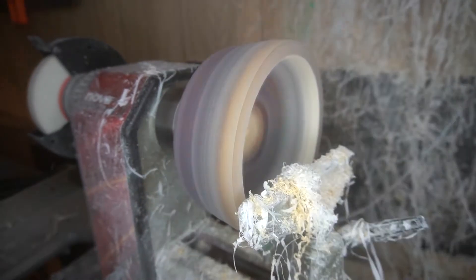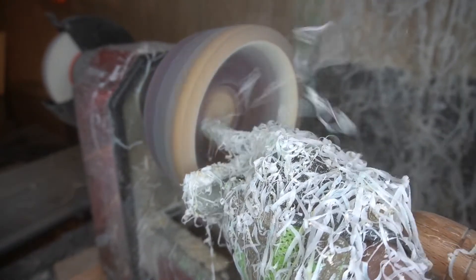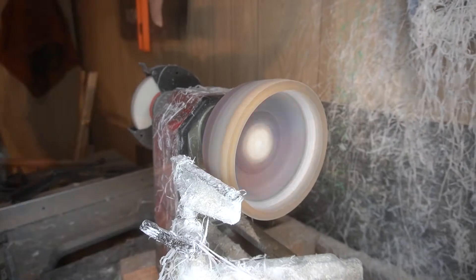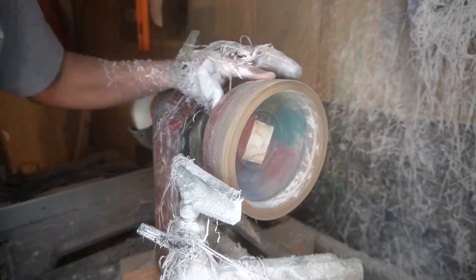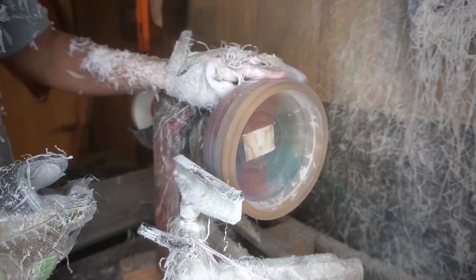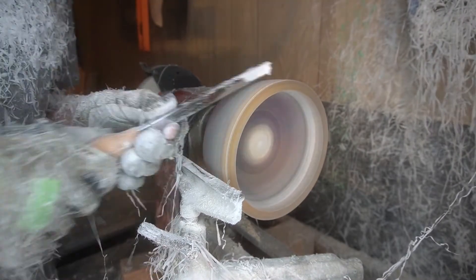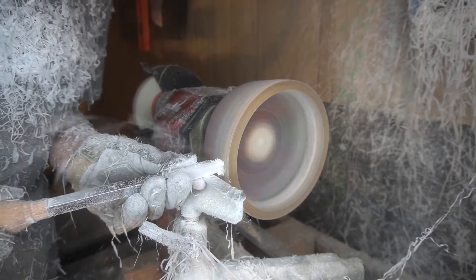All we're doing here is just basically cleaning up the bottom, going to a nice depth that we like. You saw me clean up the side lip of the bowl. The edges are a little bit longer and thicker than I usually go for. I think I went a little too high — I should have done a little bit more shallow cut on the bottom. I was cleaning up the side of the bowl. I didn't use the flat skew a lot because I did a previous project where it scuffed up the epoxy. So I'm coming back and hitting it with a round carbide tool, trying to get everything nice and flush and flat.